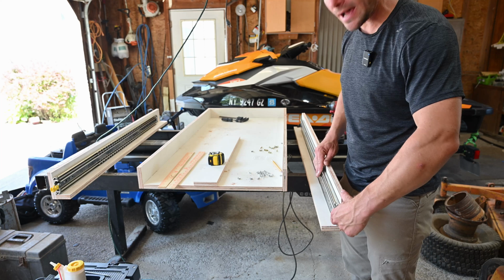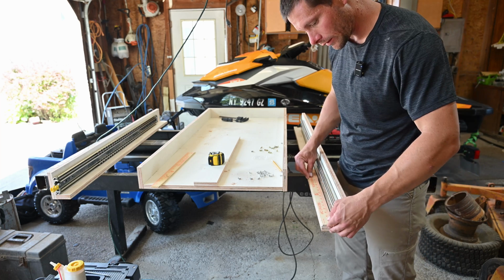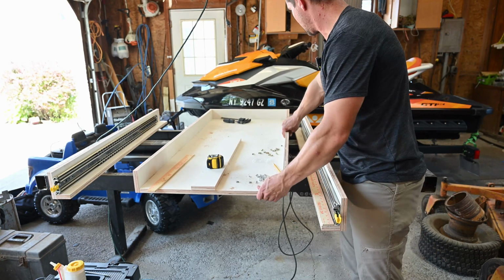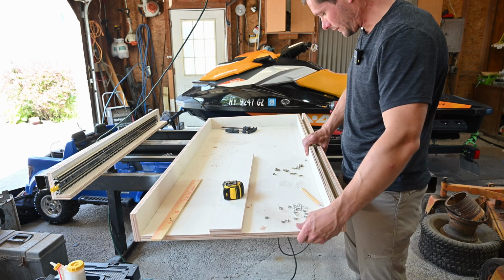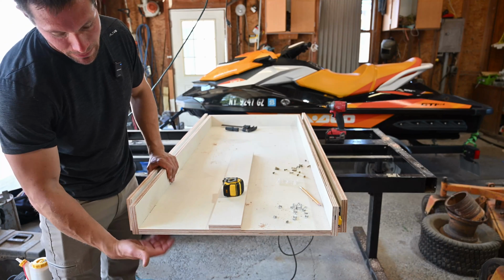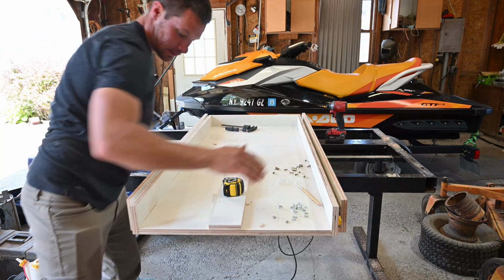Now we've got to get this drawer box mounted to this part. So how I'm going to do that is I got this wood Home Depot ruler that I'm not really going to use for much. So I broke that in half, and I'm going to use this as a spacer. So what I'm going to do is set that up there, and I'm going to do the same thing over here. Spacer is just there so that the bottom of this is not rubbing on this, because they've got to move apart from each other. So I'll make sure everything's all good and I like it.